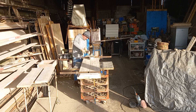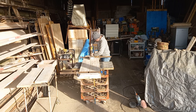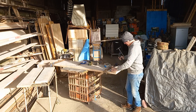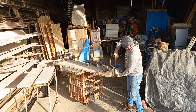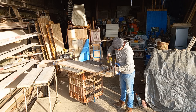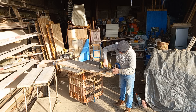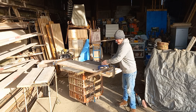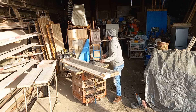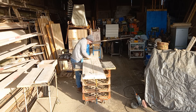I clamp them down with simple g-clamps, one at each end, then I put four screws in each board — so eight screws at each end — and that's plenty strong enough to hold it together. G-clamps on, screws in, and when that's done it's together. The actual top of the bench is already ready to go, apart from the whole thing needs sanding, smoothing and cleaning.